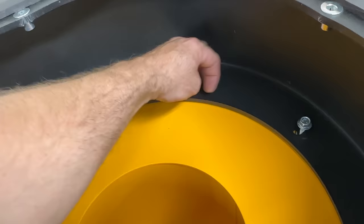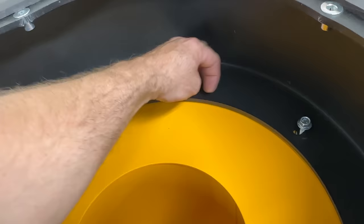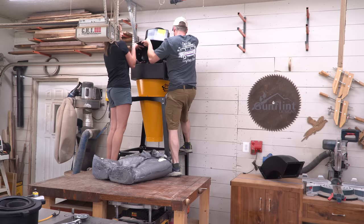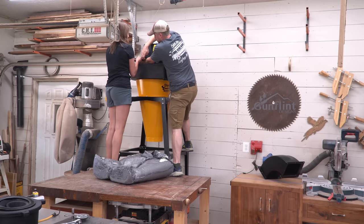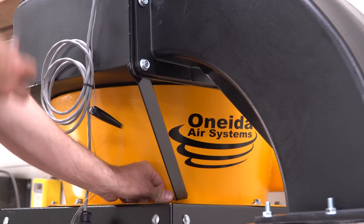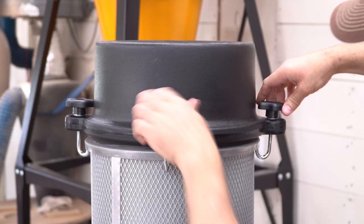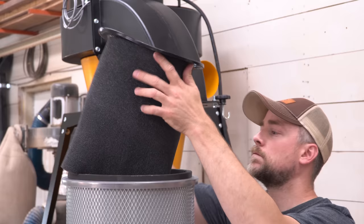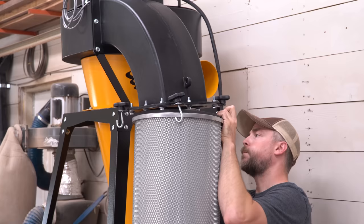Next the fan housing goes on, and once again it's important to clock the outlet in the correct direction — you bolt it down by installing the bolts through the top. For the motor assembly itself, you better get a second set of hands involved. I rolled my workbench into place so we had a big solid surface to stand on, then Katie and I lifted the motor and set it on top before tightening more bolts to lock it in place. There's an elbow attached to the fan housing, and a support brace helps take some weight off it. I put the dustbin on the filter using J-bolts, flipped it over to check if the top hat would fit — realizing it's actually a drop-in silencer — threw it in the top of the filter, then hung the whole thing from the elbow using more J-bolts. These funky bolts make it easy to remove and clean the filter in the future if it gets plugged with fine dust.